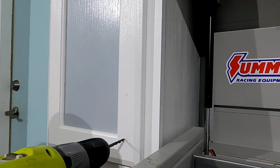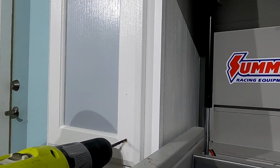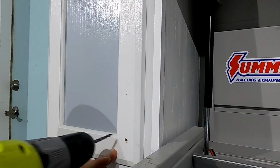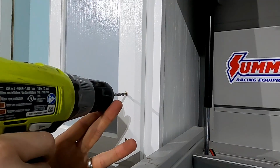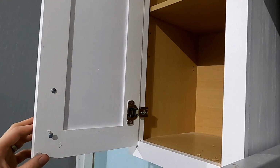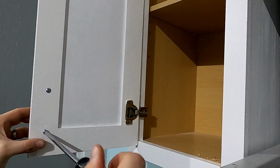Then I pre-drilled and installed all of the cabinet hardware. If I could do this again, I'd put a piece of masking tape or painter's tape over the front of the cabinet, and also on the inside of the cabinet, so that when you drill through it, it doesn't fray. Then, using the screws provided, I installed the hardware. If you like these handles, I'll leave a link in the description below.